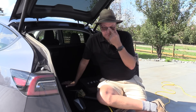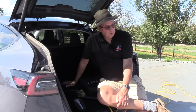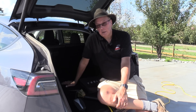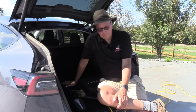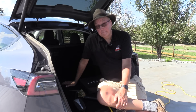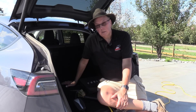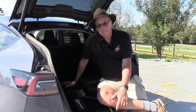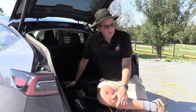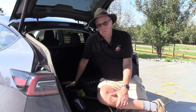Electricity is a bit complex for some — Ohm's law really helps you out a lot. We were drawing 12 amps in this number 14, and the feed voltage at the circuit breaker is 124 volts. That means we were dropping a lot of power to get it all the way down to 110 volts. By putting larger wire like number 12, you're going to have less drop and the result is you'll be able to charge the car quicker. Always be safe plugging in and out extension cords — never do it barefooted.